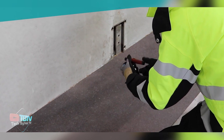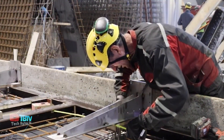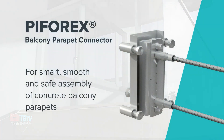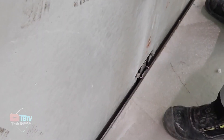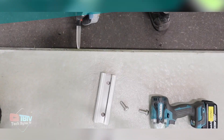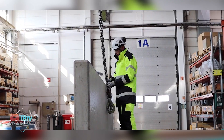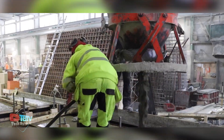Coming up is another valuable addition to the construction industry that helps create sturdy balconies. This is a stainless steel connector used to connect concrete balcony parapets to concrete balcony slabs. The balcony parapet is lowered and positioned according to plans so that the railing parts go inside the connecting items previously assembled to the edge of the balcony slab. The joint does not require welding, meaning the parapet connector can later be dismantled for possible reuse and recycling.